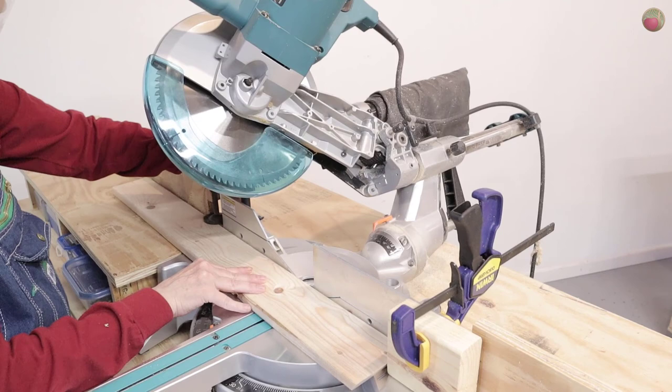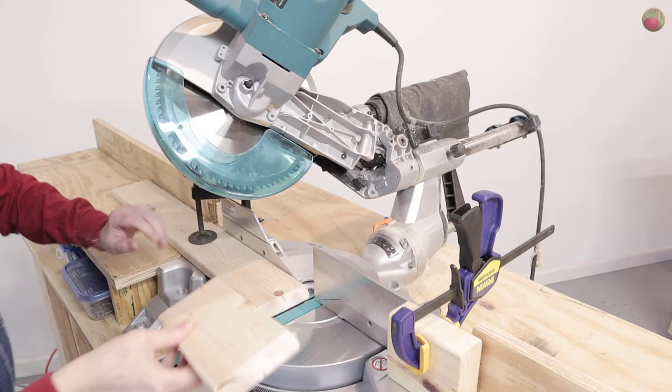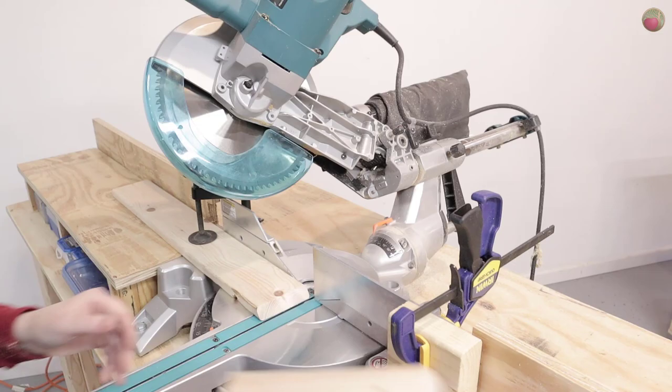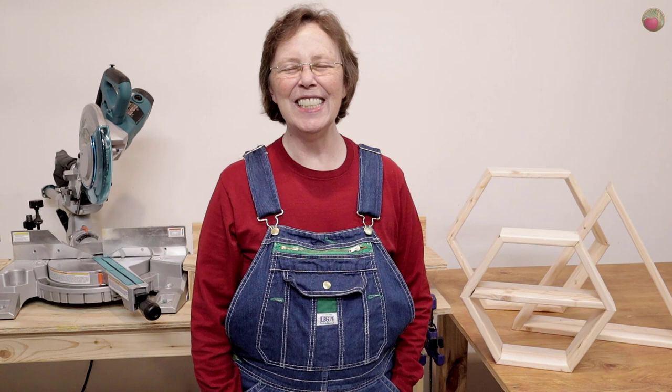Having a stop block will radically help you avoid measuring mistakes, since you'd otherwise have to alternate measuring inside and outside dimensions each time you flip the board — or be super careful to always measure either the long or short side consistently. Well, that's it! I hope you enjoyed this tutorial. Be sure to come see me at heartwoodart.com for more tips and tutorials, and I'll see you in the shop.